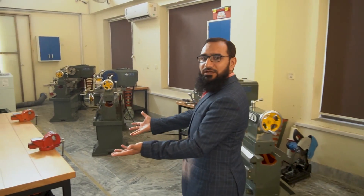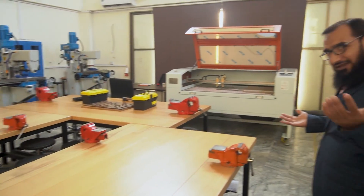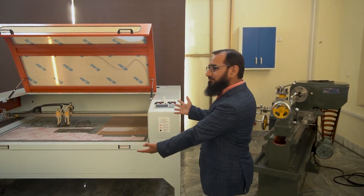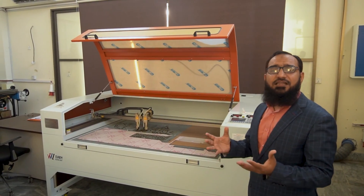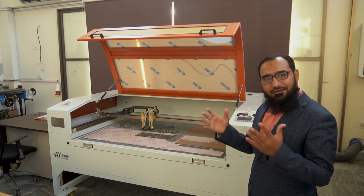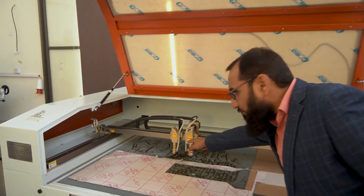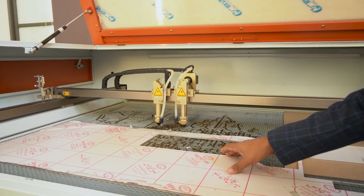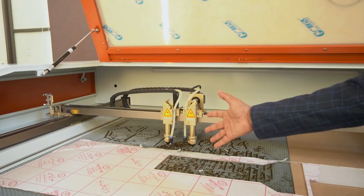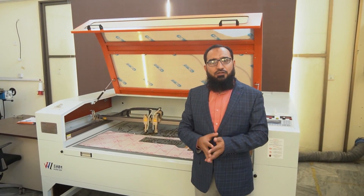Let's move forward. We have the bench work here, and we also have something very latest. Come over here — look at what we have: a CNC laser machine. With the help of laser cutting, we teach students how CNC works, including programming, G-codes, and CAD with DXF files. This is a dual-head laser with water injection to keep it cool. You can have any design you want cut in acrylic with CNC laser cutting.